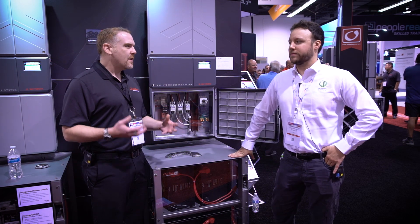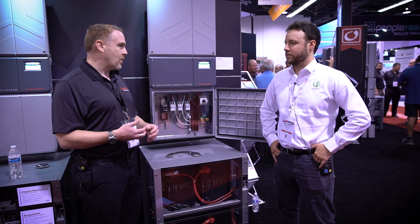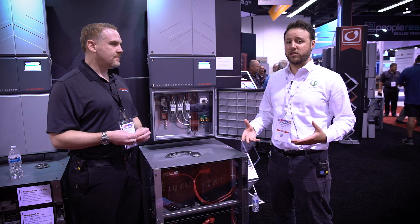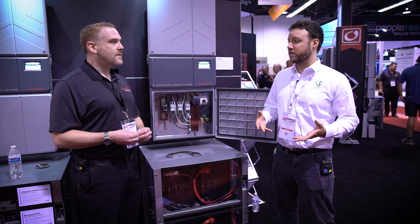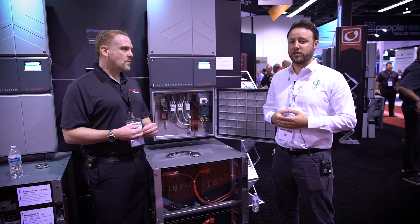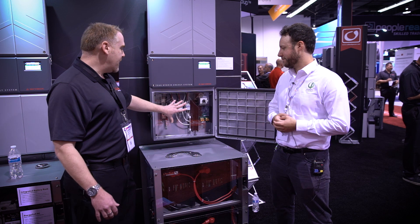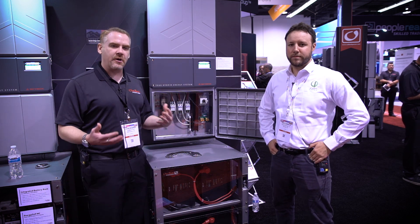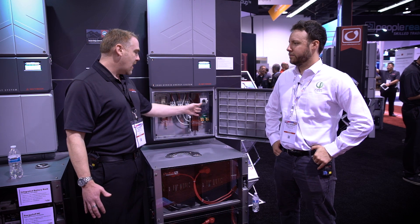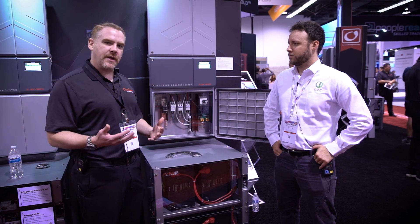With demand response and time-of-use we may actually get to that 10,000-cycle count — but we have the 10,000-cycle or 10-year warranty. You can even use 100% depth of discharge if desired, though that does alter the warranty a little bit to 3,500 cycles or 10 years, but you'll always be offered that 10-year warranty. Depending on your mode of operation you might find different depths of discharge suit different warranty needs. With the SimpliFi load center, we've simplified things considerably compared to the Radian series — all battery inputs, AC inputs, and outputs are streamlined through one system.